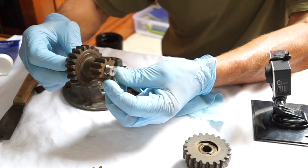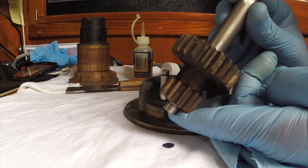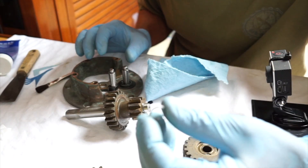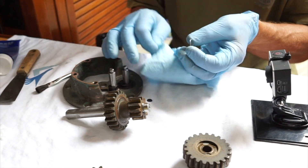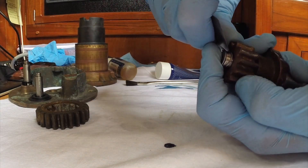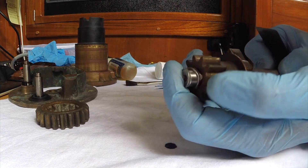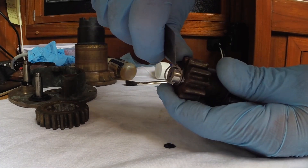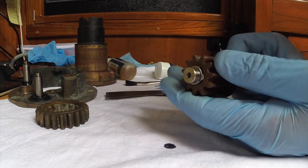This gear sits like that. There's a little circlip, and this thing has a couple of wraps on it. You see how I got it started? The best thing to do is jam that sucker down in — see how it's like a spring? It will roll eventually onto that groove in the shaft.